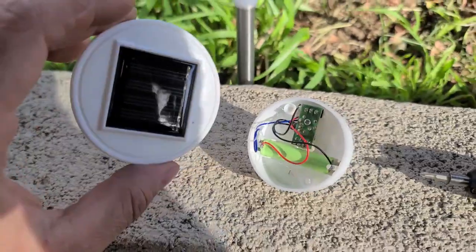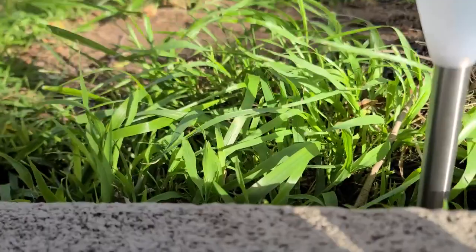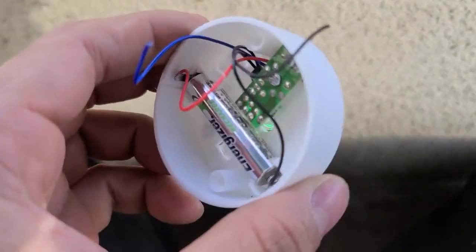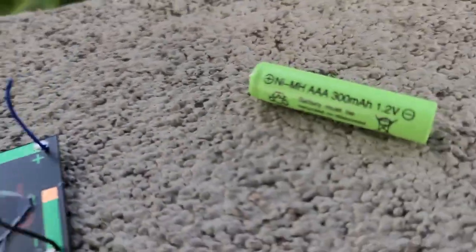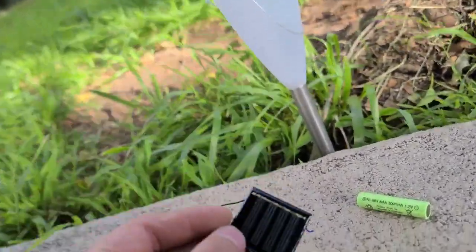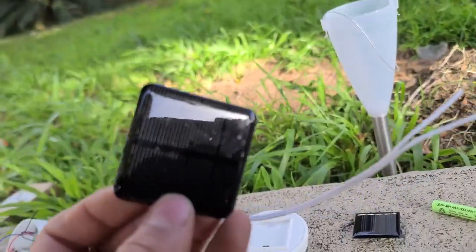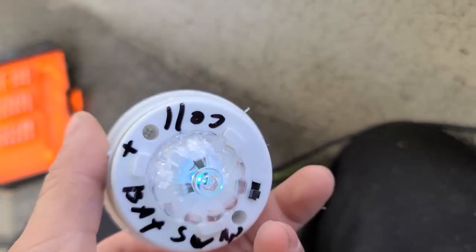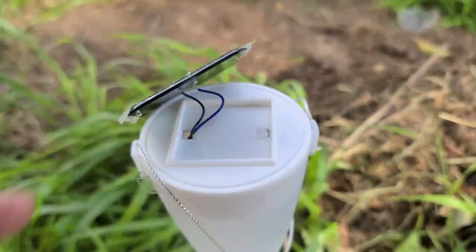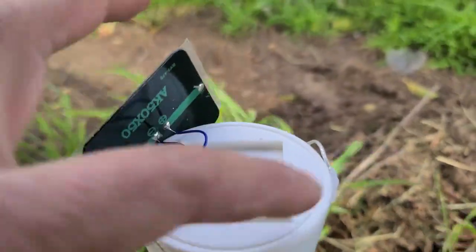Let's give that a try. I have cut the old solar panel out and now I just need to pull it out of the contraption and get one of the new solar panels in — they're a lot bigger. Battery changed, now the solar cell. They pried in the solar cell and it popped right out in my face. This is a 36x36 cell with some very pretty solar cells in there. The new one is a 50x50 and it's filled all the way with solar cells. We've got the wire sticking out — I'm just going to solder it and see how that goes. Let's hope it doesn't rain within the next few days. I'm just going to put some double-sided tape on this to mount it on there and see how it goes, to make sure it lasts longer.